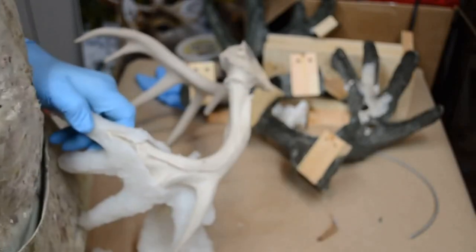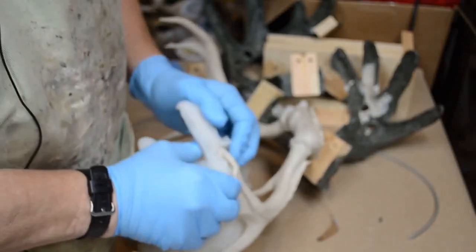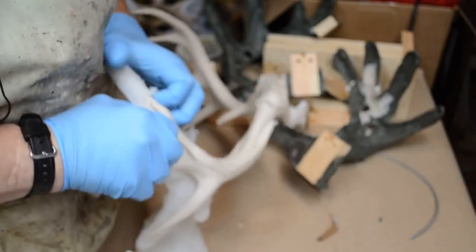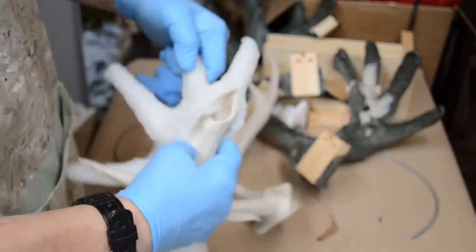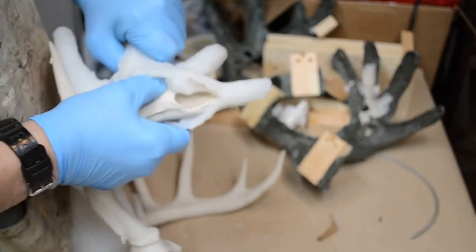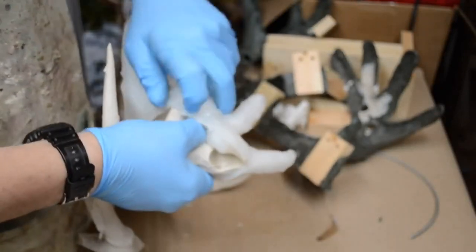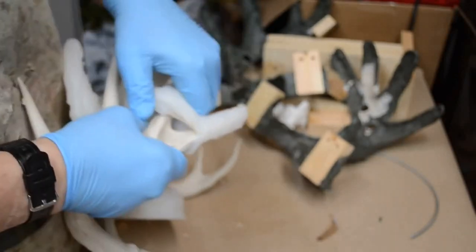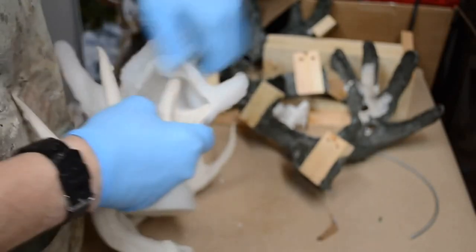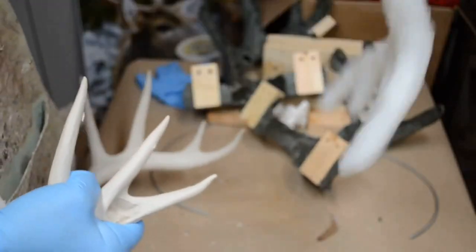the sealing silicone. Now, even though silicone will stick to itself, the fact that the mold was powdered prior to putting it back together is what's allowing the sealing silicone, the silicone glue that held the seam together, to come apart. And that may have been the culprit in not letting this completely seal.